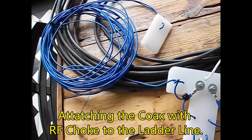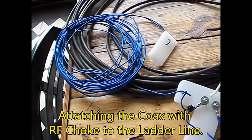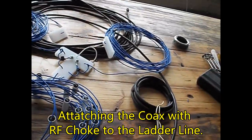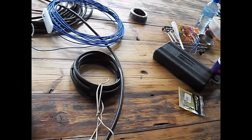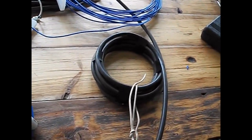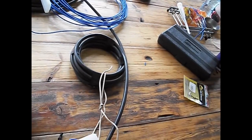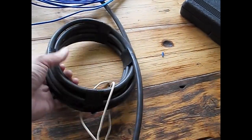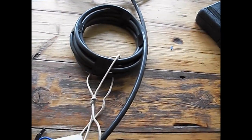So while we're finishing up, a little repair on the antenna mast base. I went ahead and finished up some work here. I got a loan — I think it's a loan — of some RG213 cable. This is six turns on about four inches for an RF choke, attached to the bottom plate.